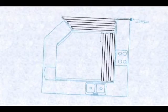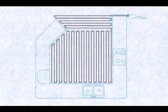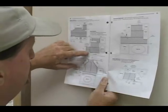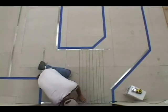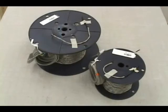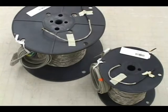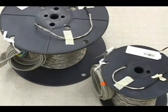The straps need to be installed to let the wire flow from one section to another. Refer to the back of the manual to help you visualize this. If you're doing a large room with one spool, your best strategy is to go to the far end of the room and work your way back. In our case, we'll put a hundred-foot spool on the left side of the room and a thirty-foot spool on the right side of the room.